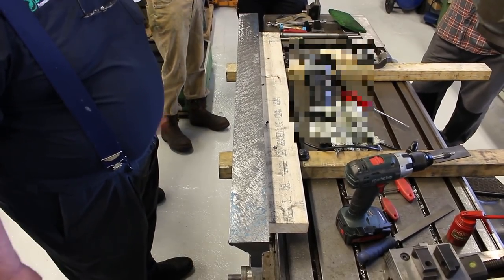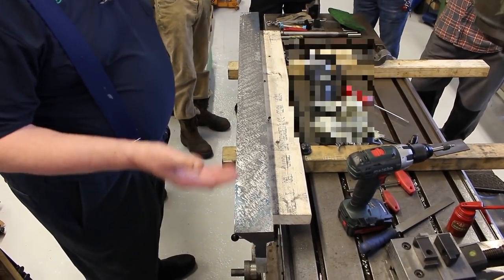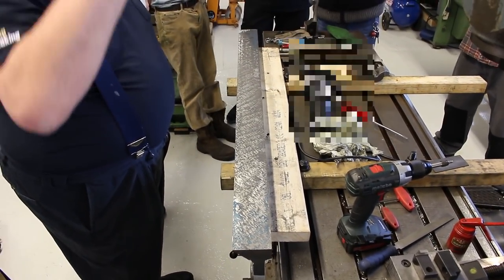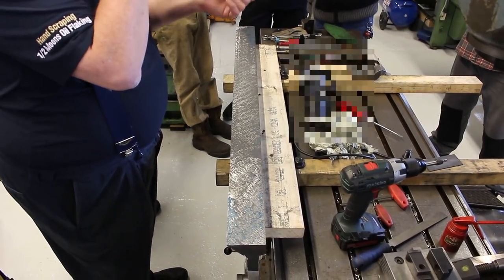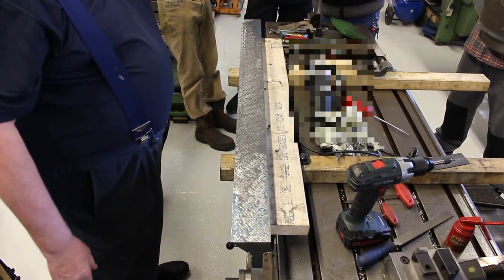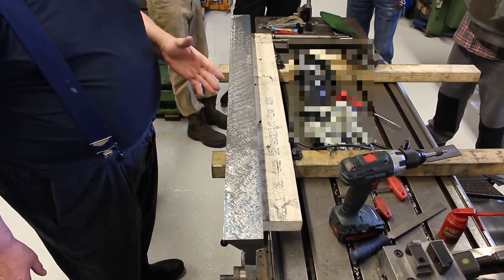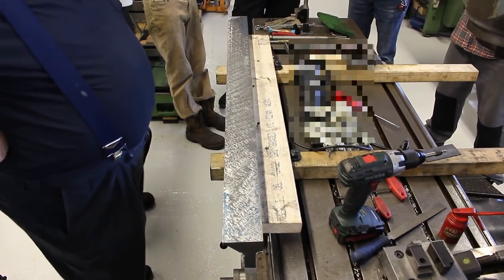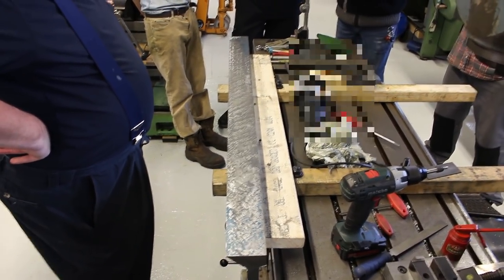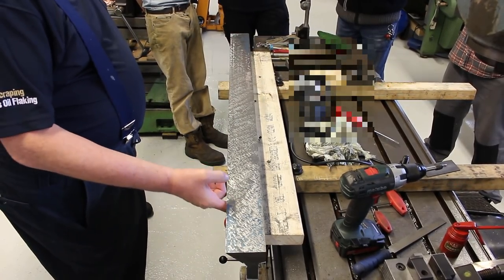Yeah, and like I was trying to say the other day, when we make these things, we do it on a planer, and we turn the head so it's at 45 degrees. We don't get in there with a sine plate, and we don't get in there with a gauge that you set and take into your optical comparator. We don't care if it's exactly a 45. Somebody on Practical Machinist just recently wanted a straight edge with 50 degrees, plus or minus like nothing. Well, why? Well, the part that this sits in is 50 degrees.